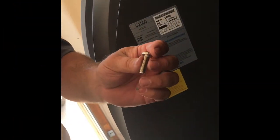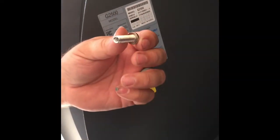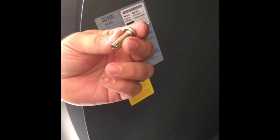All right, now we're going to assemble the topper to the ATM using the bolts that came with the mounting brackets. First thing you want to do is take the little plugs out of the bolt holes here. There's 2 of those. We'll take out the existing grommet that came with the ATM and put in the new one that's got the opening there for the cable.